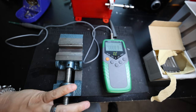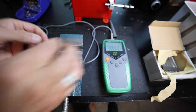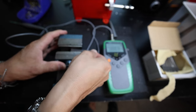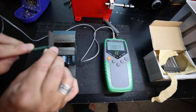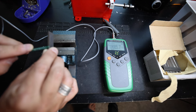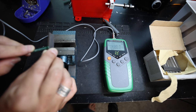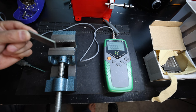We're going to put this magnet in between those two magnets in the vice, set the depth just wide enough to pass it through, and pass it back and forth a few times. Let's do about six passes. Now we measure it — 680 Gauss. That's solid for an Alnico 5. Note that you have to hold the probe in the right spot; if you hold it wrong, the reading will drop. But there we go — we've successfully magnetized this magnet.